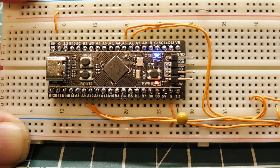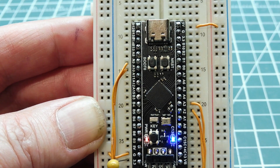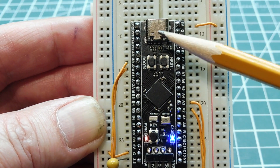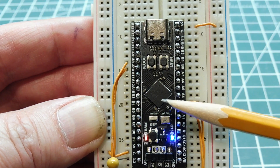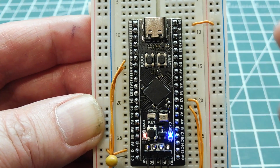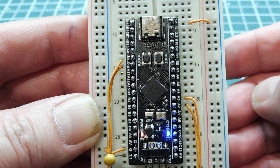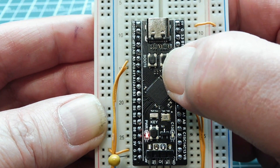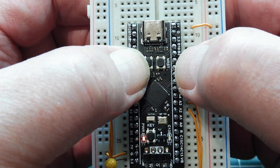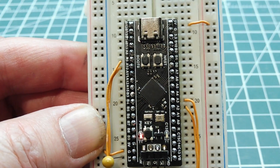Those are three ways to upload a hex file into the STM32F411 Cortex-M4. To upload via flash loader through USART1 or via the USB port using DFU, we have to put the microcontroller into bootload mode using the reset and boot zero buttons. You can see the LED is on indicating the Forth OS is running. To enter bootload mode: hold the reset button, then hold the boot zero button, release the reset button — the microcontroller sees boot zero is pressed and enters bootload mode. When I release the boot button, the LED is off, confirming bootload mode.